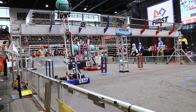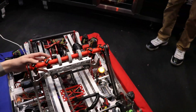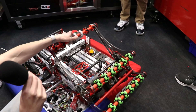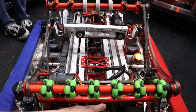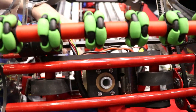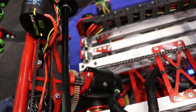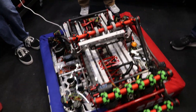On the end here we added this algae fin — as we call it — we use these vector wheels to help center it and we just pinch it with the omni wheels for the coral intake and the vector and flex wheels here. You'll notice we actually use PAHT carbon fiber printed with our Bambu Labs X1C; we've used that for our knuckle block for the wrist as well as the part attached to the gear of the turret. We really want to keep the turret as light as possible while still getting a lot of fast functionality.